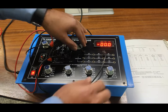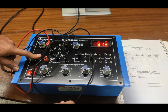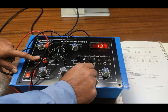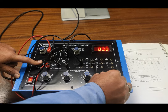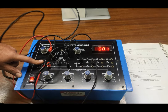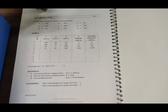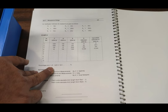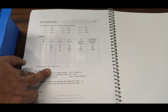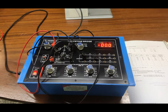We can also complete the experiment with higher resistance values. Increasing R up to 100 ohms on the R arm, the galvanometer null is achieved at approximately 97 ohms. So the calculated value is 97 ohms against the actual value of 100 ohms. You can find the percentage error using: S is the accurate given value, and S-dash is the measured value. The percentage error can be calculated from these two values, demonstrating the practical accuracy of the Wheatstone Bridge.